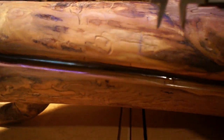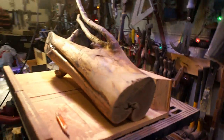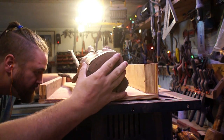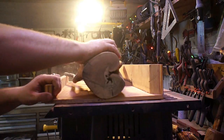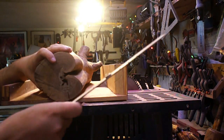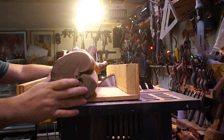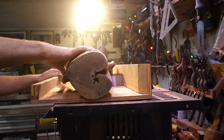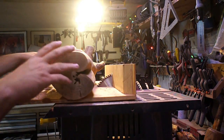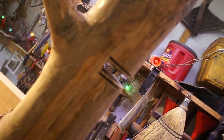The recurring theme now is how to make all those shelves level. This piece is actually going to be for two levels of shelving. My brother had an idea — why not cut out a section in the middle and put the board in there, having it lay on it like a little shelf. I thought that was pretty cool. So I went to the table saw and basically made a bunch of cuts, just hollowing out an area. I was measuring on the base earlier to make sure the cut was parallel with the bottom of the board, and it worked pretty well. I had to shim it up a little bit, but you can see how I hollowed it out.